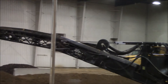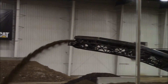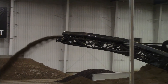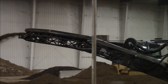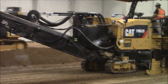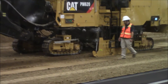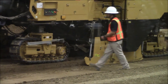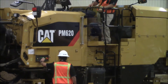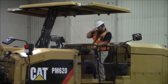Another feature of the automation system is called obstacle jump. As our operators are coming through the cut, if there is an obstacle — let's say there's a manhole cover or a manhole out there in that cut area — using this automation system, they can actually go up to that obstacle, come up out of the cut or out of that previous grade, tramp over that obstacle, and then the machine returns to the previous cutting depth in auto, helping to simplify a currently manual task.